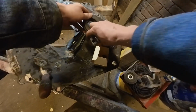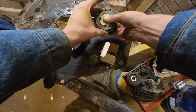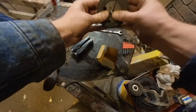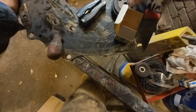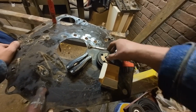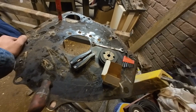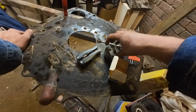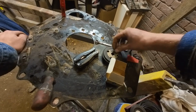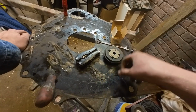Because what's happening is, no matter how much I tighten these grub screws, it's going flush like that. It's not catching on the shaft. I've got it tight. It's even twisted the Allen key. I'm bringing that tight, and the pulley just pulls off. It's completely flush on the shaft, like there's no wobble. The only thing I can think is there's some wear on the shaft, but I would have thought that would bite down enough to clamp on the shaft, so it doesn't.